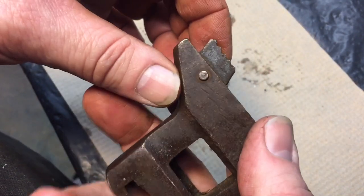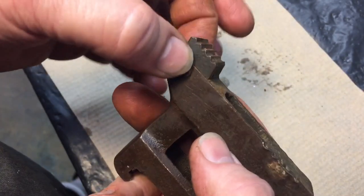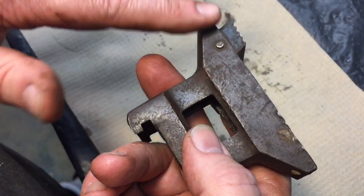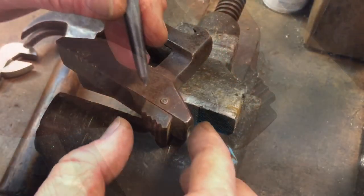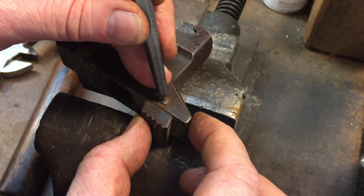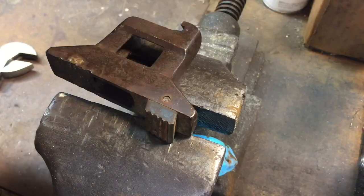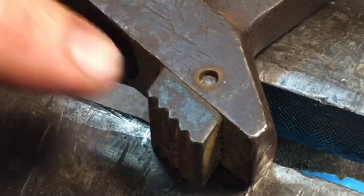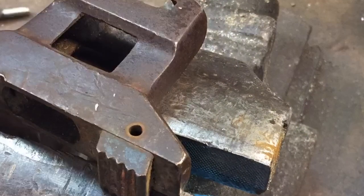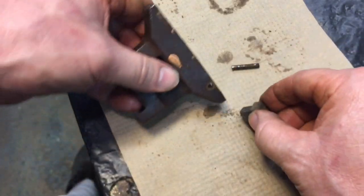These are replaceable jaws here — this little pipe jaw. Normally I don't like to disturb it, but it's protruding, a little proud of the surface. If we're going to work any kind of grinding across here, that pin is going to be a problem. So we're going to have to pop it out. They're made to pop out because this is a replacement jaw. To remove that pin, just take a pin punch, put it directly in the center of that pin and give it light taps to begin with. Then take a punch slightly smaller than that pin's diameter and drive the pin out. Once you remove the pin, slide the jaw out — there's a little pocket that the jaw fits in. Now you clean that up separately.